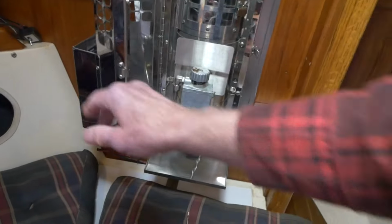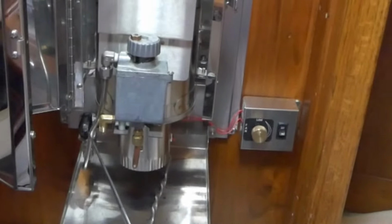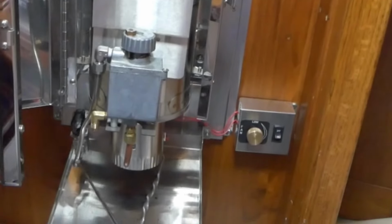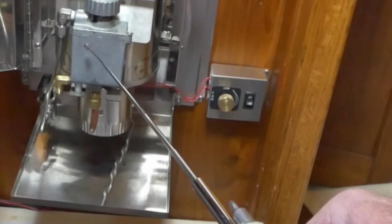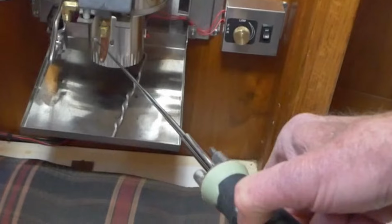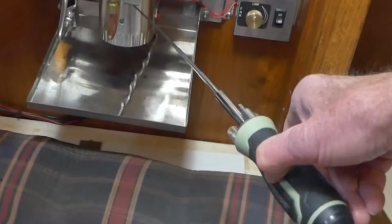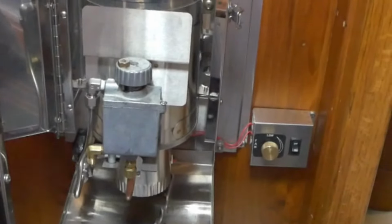And then inside here, we continue with the tubing, which I had to make a profile to get around the door, so there's enough space for this to come in. Another swage connector goes into the metering valve here, and this is what came with the stove. These are regular swage connectors going out, and then finally to the fire pot down there in the heater itself.